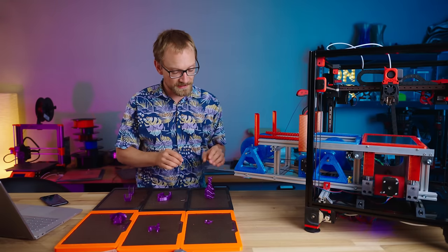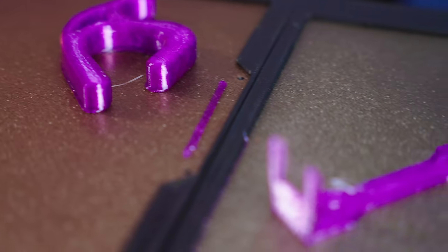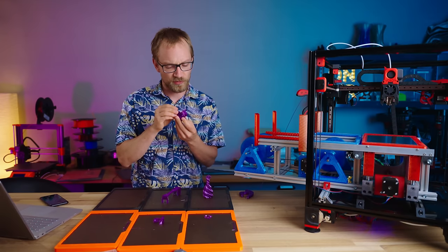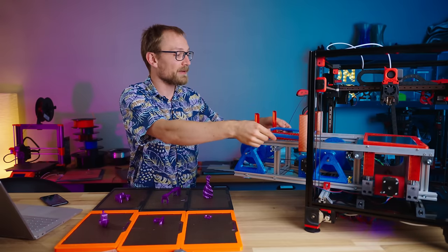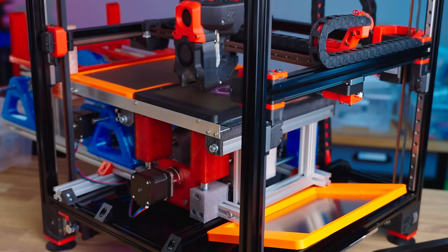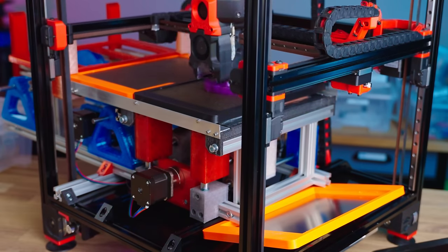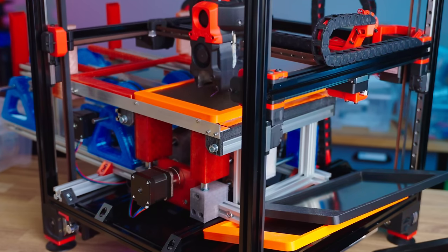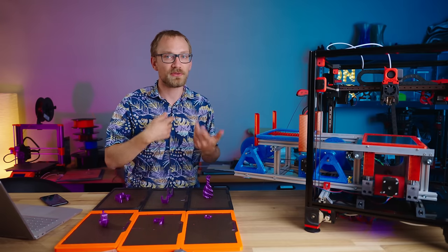Alright, so that's six prints done — we've got a small vase, Flawlistique's ring, a new fan shroud for my Prusa MK3, a table hook, a jig for doing decking, and of course a 3D Benchy. This one actually looks pretty good, except for the stringing. These prints were all done without any intervention. Well, not quite — I did have to replenish the bed magazine because there is a dead space of one bed between the magazine and the print platform, so it always needs one extra bed in between there. And also, to eject that last print, it needs one more bed to push that out. But other than that, as long as the hopper is fed, this did not need any intervention or interaction from me, and that is exactly what I was going for.